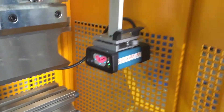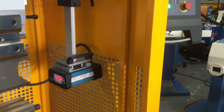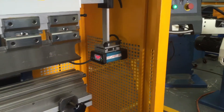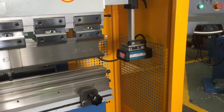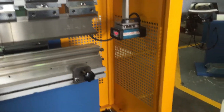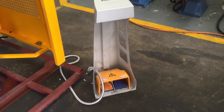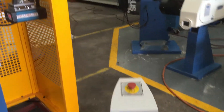We've moved away from the old frame-mounted guards that were mounted to the outside of the frame, which were cumbersome and difficult to use because they would stop the operator from walking in as close as needed. Other features on the machine: we've got twin foot pedal operation — one for up, one for down, with an e-stop on top of course.